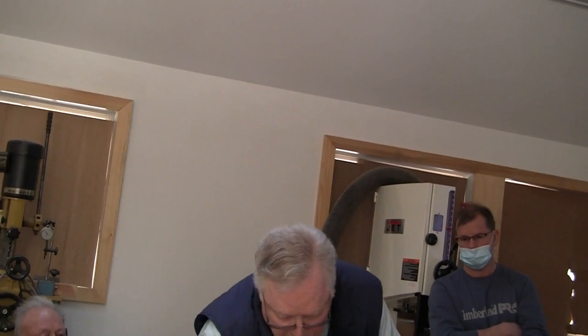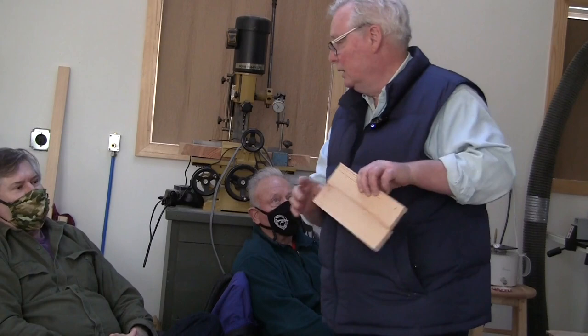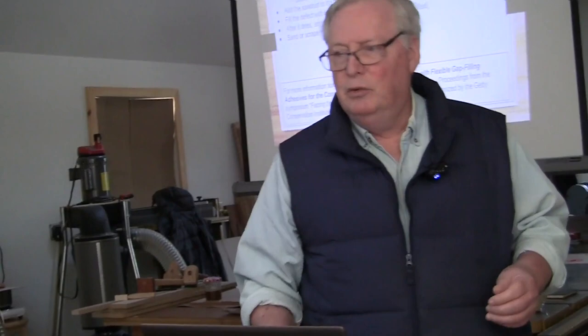Looks like I didn't make a very good glue joint here. You can feel this. It's a little sticky. Yeah, so I would just scrape that off, let it dry, and then I would use a scraper on it later on. But even if it ran down here like this, I'm going to do this joint again. Oh, I didn't join this board correctly. It's joined perfectly fine in the back. It's open in the front, crappy planing job. But cleaning up after hide glue, it's really not an issue.